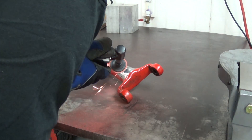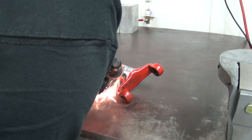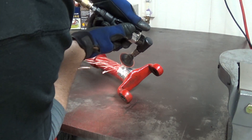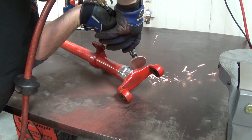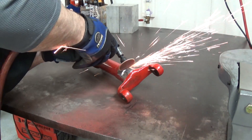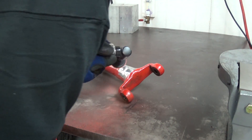Just using the angle grinder to open up the groove a little wider — make it more like a 45-degree angle or wider. You want the groove to be wide enough so that you can penetrate down in there and get a good root weld. This is going to take several passes, especially since we want to be able to finish grinding the weld and have it invisible.